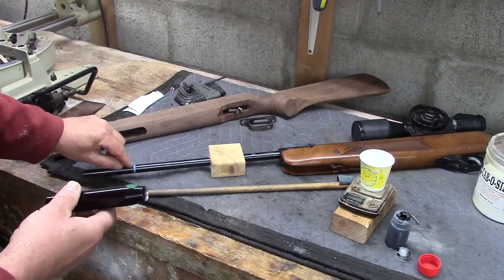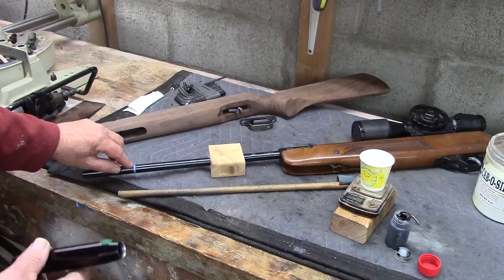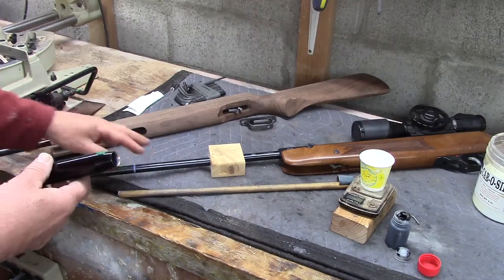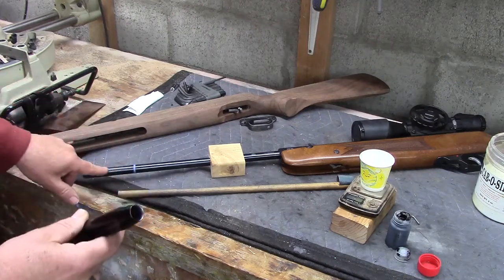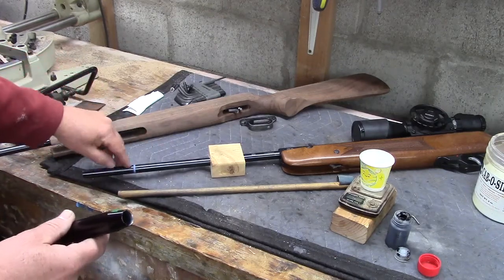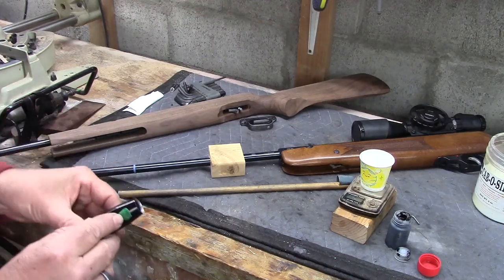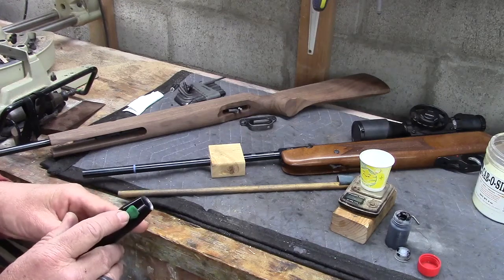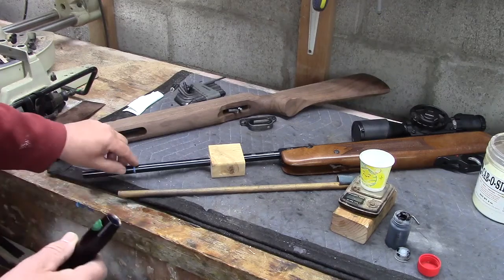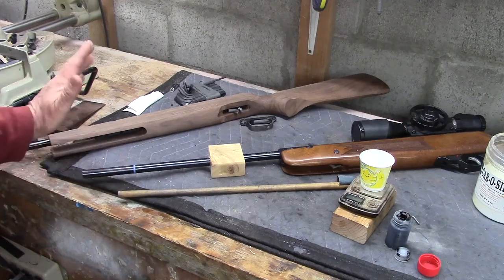I sliced really thin strips of painter's blue masking tape and laid those on there - really thin because they're going to be encapsulated by the glue that's going to glue to the brake, not the barrel. This is going to have to be beat off. I didn't want a wide piece of tape. Additionally, I placed it right where the grub screw hole is located, so that if I need to put some mineral spirits down to soften this tape, I'd be able to. But I really don't think that's going to be necessary - I think this is going to come off just effortlessly.